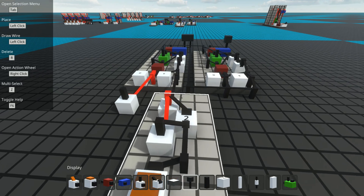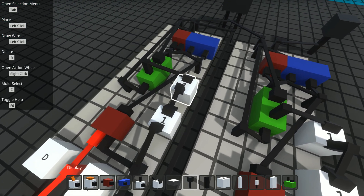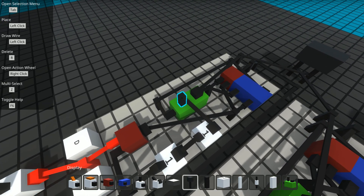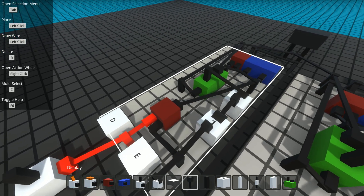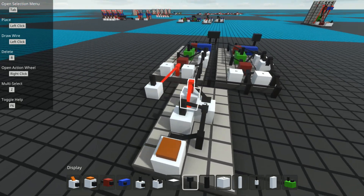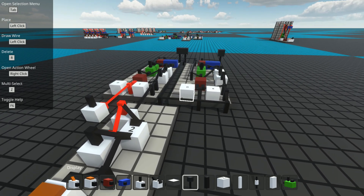I hope that's helpful — it's a little hard to explain. I wish the circuit were simpler, but I needed these delays here to ensure the enable doesn't happen too quickly. I want the enable to happen at the right time to latch the value as it comes off the half adder circuit, and I added that AND gate to make sure it wasn't doing things when I didn't want it to. I'm sure there are simpler versions, but hopefully this was instructional. Thank you.